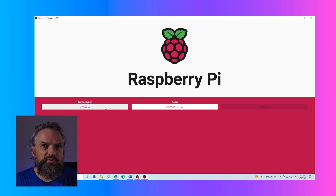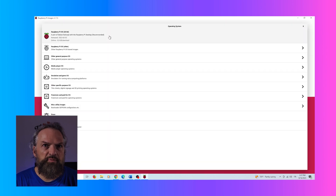If you have updated your Raspberry Pi with the newest Raspberry Pi OS Debian 11 called Bullseye, you can no longer use the old raspistill and raspivid commands, because they have been replaced with the new libcamera applications. As older videos on YouTube are based on the old framework, it's better to refresh our knowledge.